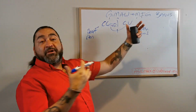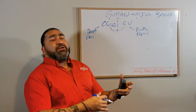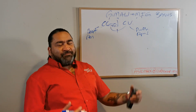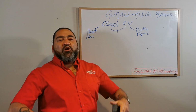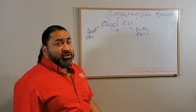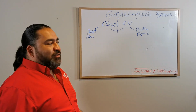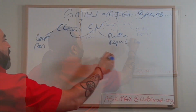And we know, hey, if you've ever stick welded a MIG weld, you know what I'm talking about, right? I can make the prettiest welds with GMAW. I cut them in a saw, and there's no penetration. Crack. I can have the ugliest weld in stick, and it'll bend perfectly clean because it penetrated so well. But it's so slow. No one's making money on stick unless you're in the oil patch, and we know what happened with that, right? So now, what happens?